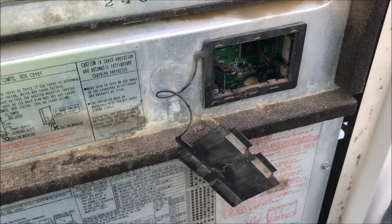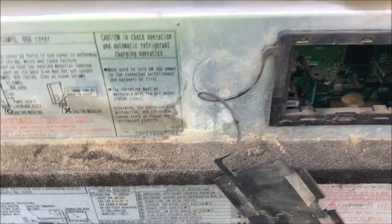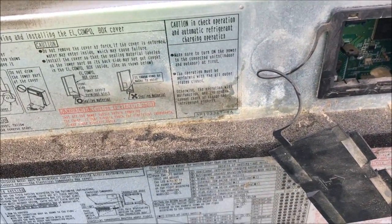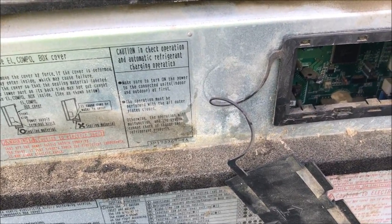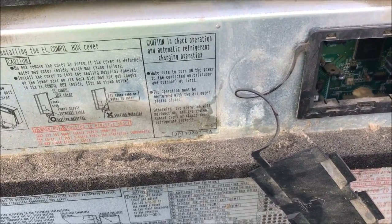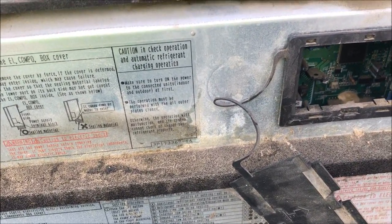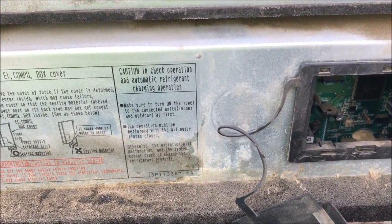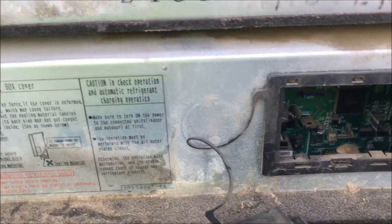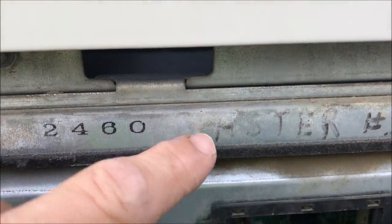This school here hasn't had a lot of compressor changeouts. We've had issues, but they've just been mechanical, like reversing valves. We had an EEV actually leak and had to be replaced. But I wanted to show the first steps of checking out an error when you get one. The error we have is an L8, we know that, but I want to show how to check it on the board and decide which side it's on, either the master side or the slave side, and determine which side's the master if it's not written somewhere.